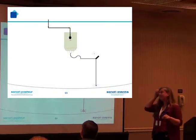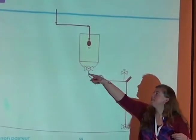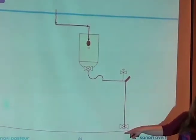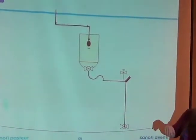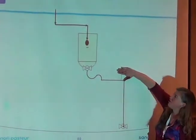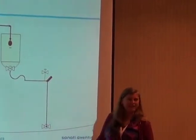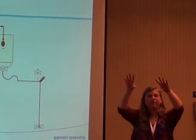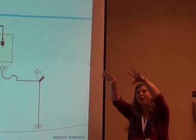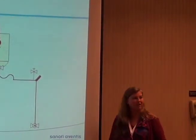Here's an example from one of our facilities. There was a tank, and to do the CIP they hooked up a flex hose to a hard pipe on the wall. When we did the URS for this tank, we said we need the ability to sample the CIP. The engineering group gave me a stand pipe. I said, what is that? They said, well, that's your ability to sample. I said I need a valve. They said, oh, we thought you could put your own valve on there. The URS didn't say — one of those volleying situations where you go back and forth with engineering. So I had full knowledge on this tank, hooked up the flex hose. The stand pipe literally came up out of the pipe vertically, and I said, how am I supposed to get flow out of that?